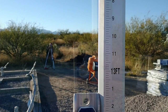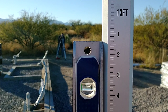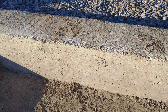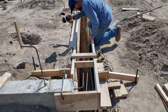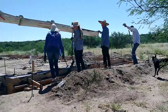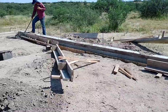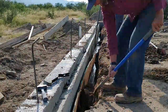Our original plan was to pour aircrete for exterior walls, so the footer level didn't have to be perfect — we were just going to pour a wall on top anyway. However, now that we've changed to a more traditional stick-built style wall, the footer level becomes very important. I had to go back and recheck everything with a transit, measuring the elevation and levelness of the entire footer. There was one section where the forms blew out and warped a bit, and we were worried it might be far off. We checked every five or six feet around the perimeter and also the interior footers.